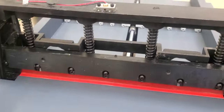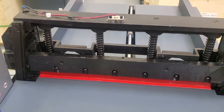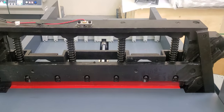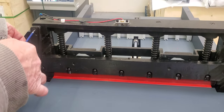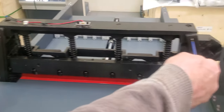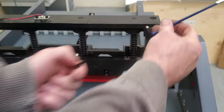Once your clamp and blade is down, we're going to remove this top part. There are really only four screws that hold it in place. These are 4mm — you're going to want to break these free. I loosed these to make it easier; you'll have to break them when you do it.